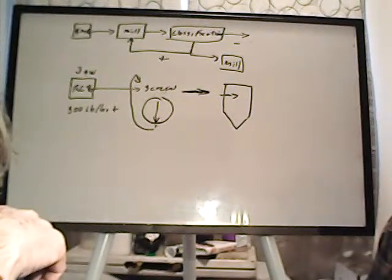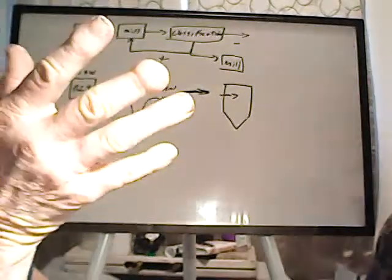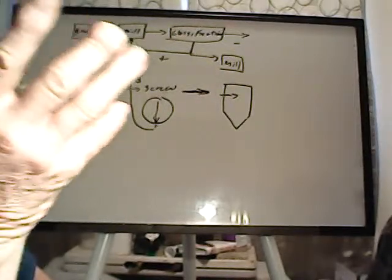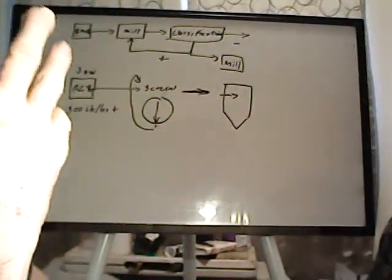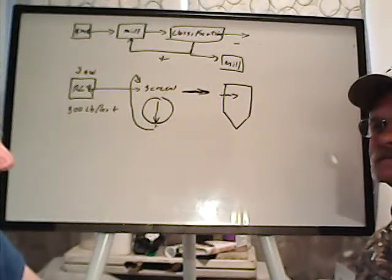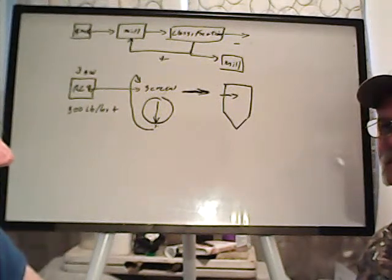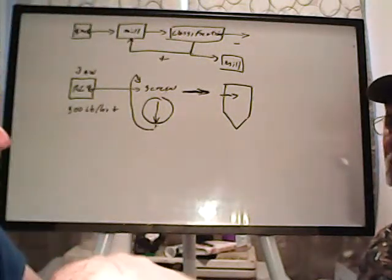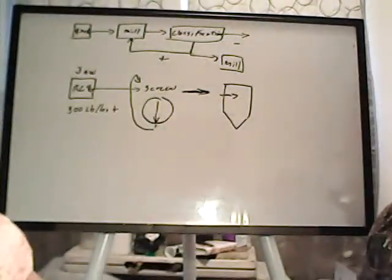And so I think the whole issue has to do with the temperature the element is operating at and the support of the element. Now, there's a couple things I thought of on how to improve this. First of all, we can go to a higher temperature element material. There's something called Kanthal, which has about a 400 degrees hotter operating temperature. So if we were running it at the same temperature, your longevity is going to be a lot better. Right, it's a much better coil within its range. Yeah. Right.